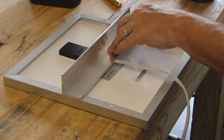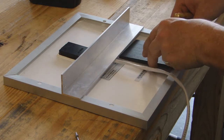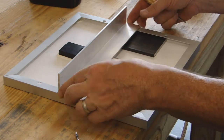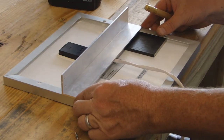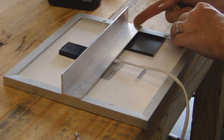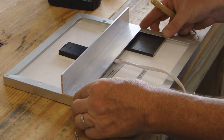I'd better mark this really quick. Prior to drilling, you want to use a piece of steel or something to protect your solar panel so that when you are drilling, it won't go through to the solar panel. You also want to keep your hole as far away from the edge as you can and still get a good connection with the pop rivet.